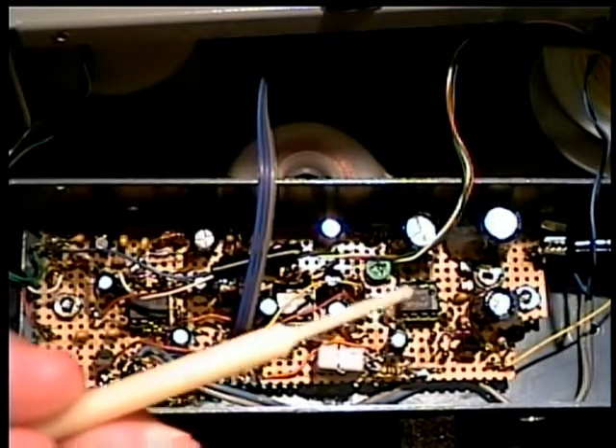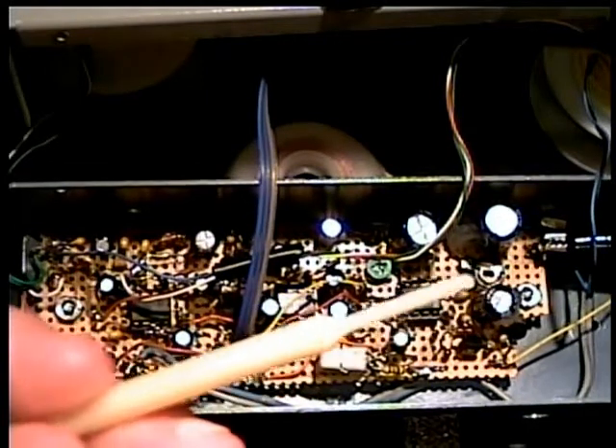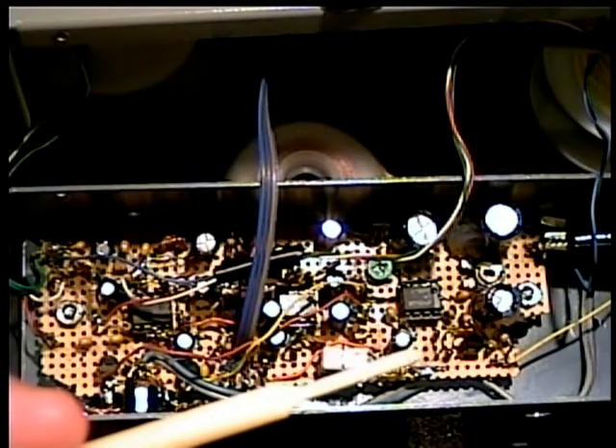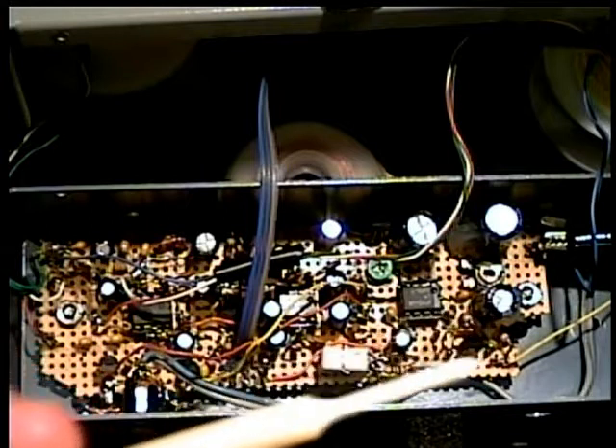One thing that caused me to really stumble — it took three weeks to design this circuit, run experiments, and get it working — was that just a few microamps of leakage through this capacitor was appearing on the ALC line, causing the ALC to fail to go down to zero when the ambient audio level was low. What I had to do was take a 100-ohm resistor from the load side of the output coupling cap to ground, which bleeds off that leakage. That was a major problem.